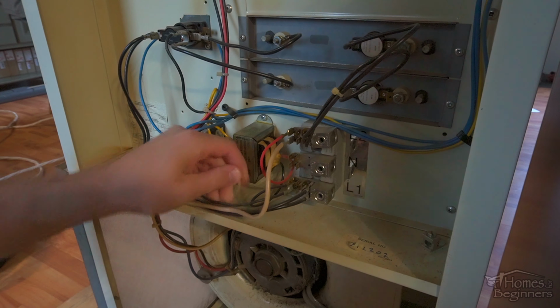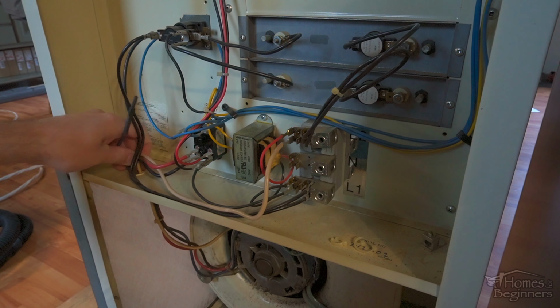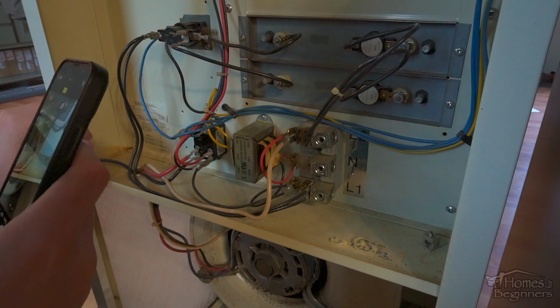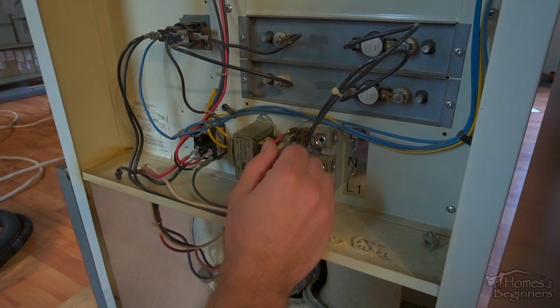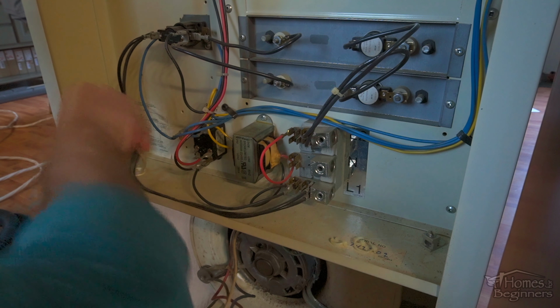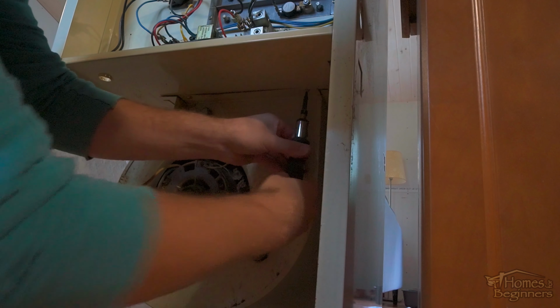This furnace is an older model and fairly simple to work on. Some of the wiring will need to be disconnected in order to fully remove the blower motor. This is the easiest method for cleaning. Once the wiring is unclipped and disconnected, then feed it through the hole. We only need to disconnect the wiring for the blower motor. Remember where all the terminal connectors are located.